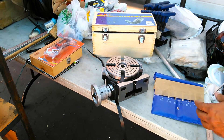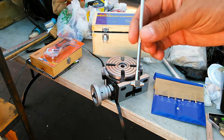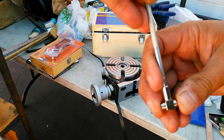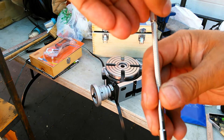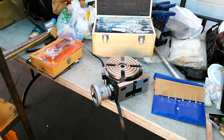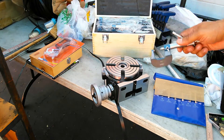The way it works is: when you put it in the bore, once it gets down to the thickness it actually pushes the anvil in and out. Once it gets to the thickness, you lock it down, and then you measure it with a micrometer — so that's my one-inch micrometer.